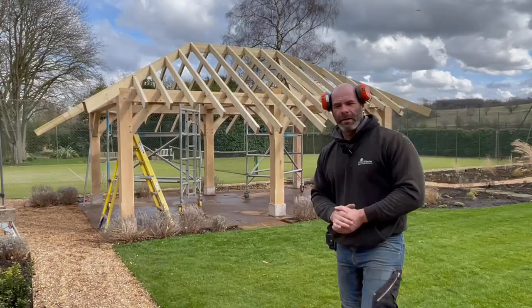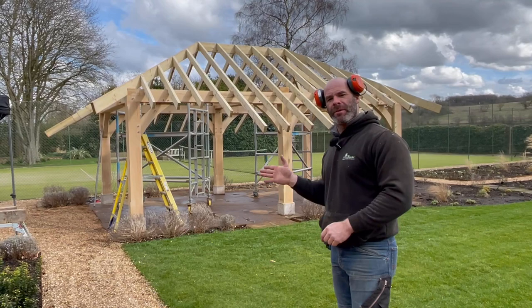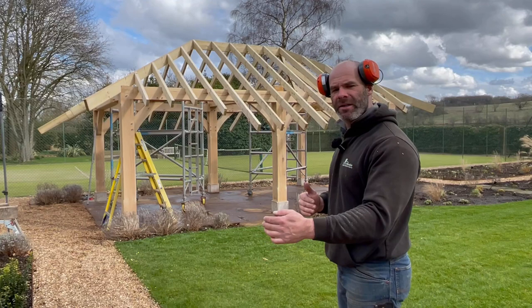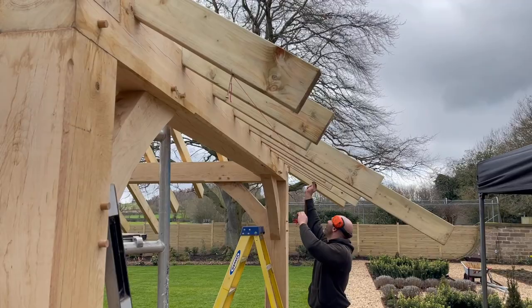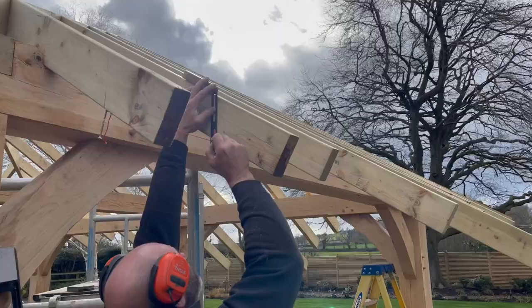Rafters are done. I do very much enjoy putting hand cut roofs on, which leads me on to the plumb cuts — the cut at the end of each rafter, which not surprisingly is plumb. We've been round and measured 300mm off the wall plate; that is going to be our eaves overhang detail. That's substantially more than we normally put on, but that's what's been designed on this one. We have done it before and it does look very good with that additional extra overhang. String line is up, we've been round with our angle finder and marked all the plumb cuts — now it's just a case of cutting them off in a nice neat straight line.